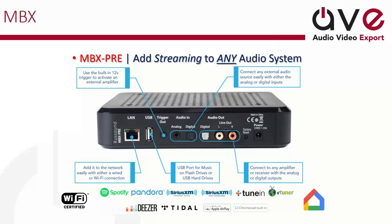By adding an MBX Pre, you're really allowing yourself to stream to any audio system that exists. If it has a digital output, that's my preference — if you can go digital, go digital on your outputs. In this case we're looking at Toslink output. If you don't have Toslink and only have coax, you can go RCA, no problem. Any amplifier will be able to receive one or both of those. You've also got an analog 3.5mm input, and a Toslink input as well. I prefer digital because the devices internally are digital, so you save processing power and maintain quality by keeping everything in the digital realm.